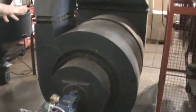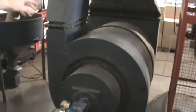You have the actual burner right here. You can see just some more parts of the roaster. So this is our heat source. The way this particular roaster works is you fire that burner into this chamber. That large chamber runs at about 1400 degrees. You're drawing heat through those black pipes down over the coffee for the roasting part of it.